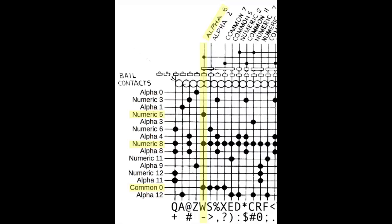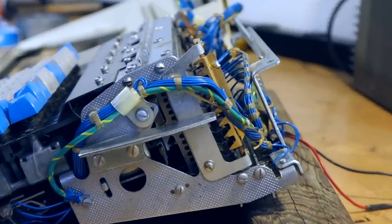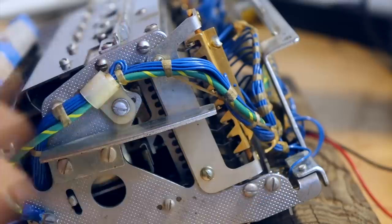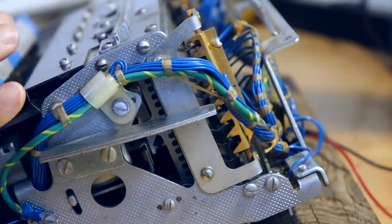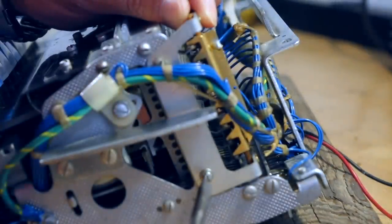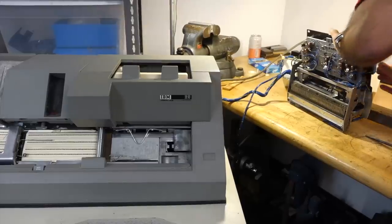Forward to 1964 and computers are taking over. The 029 punch's main innovation is to add many more special characters, used primarily for programming. Its new keyboard has one shift character for every key. But by very clever contact reshuffling, they managed to support it by extending the use of the bottom latch contact to every key, so they kept the 15 bale contacts, using the exact same mechanical design as the 026 keyboard under a new skin. However, the wiring became somewhat illogical and the simple relationship between punches and bales was lost. Coming back to our W key — you can see that it will punch 0 and 6 in alpha mode, which is indeed a W, and 0, 5, and 8 in numeric mode, which is a triple punch for the special dash character. My keyboard is back out again and you can see the problem: the bale contacts are always closed and I need to adjust them.